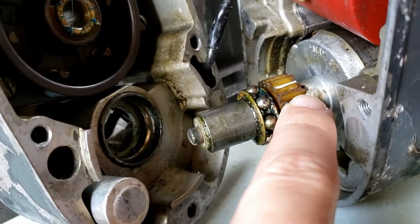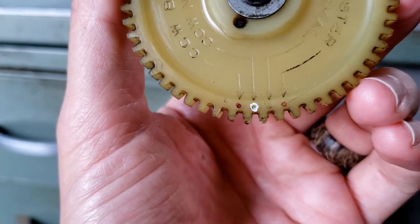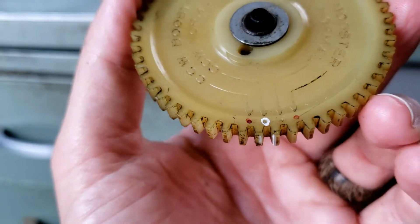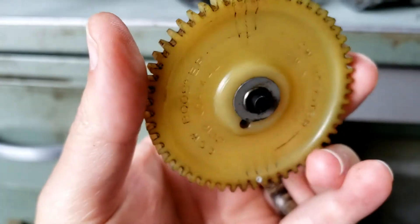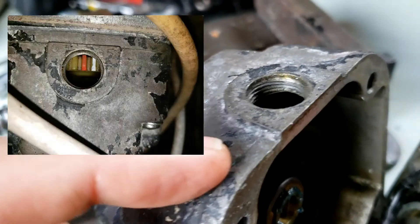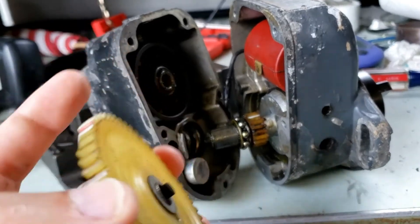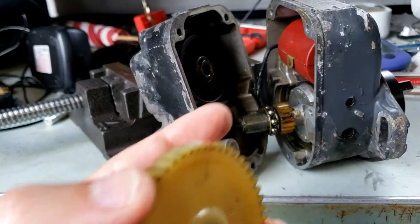The chamfered tooth goes into — there are a couple of different marks. The normal one you see there I painted in white, so that spline has to go in between those two white marks. When you do that, that puts this right on cylinder number one — pretty straightforward. When you do that, these marks should also show up in the timing window here. One of the things I did is I had this in the right area, but it wasn't on the right tooth — or I had it all aligned properly but it was not at top dead center. So I had a couple of different interplay effects going on, but I think I've got it right now.